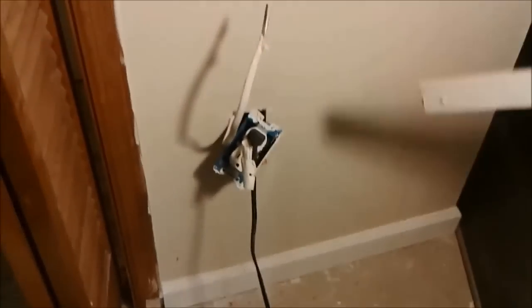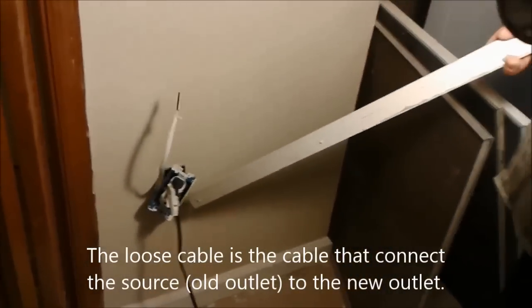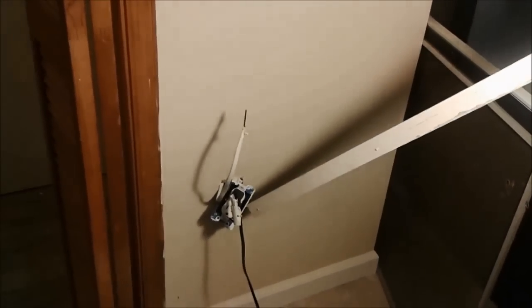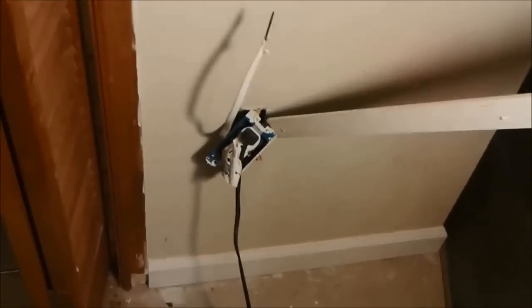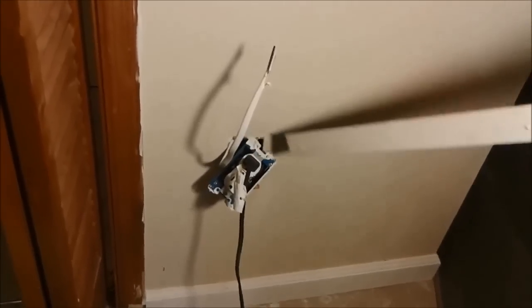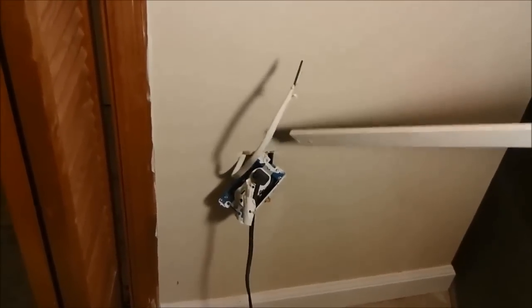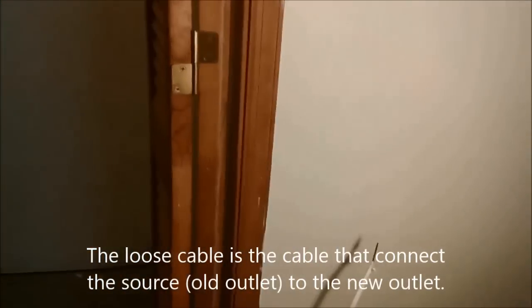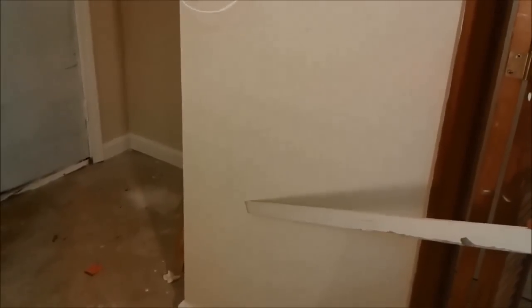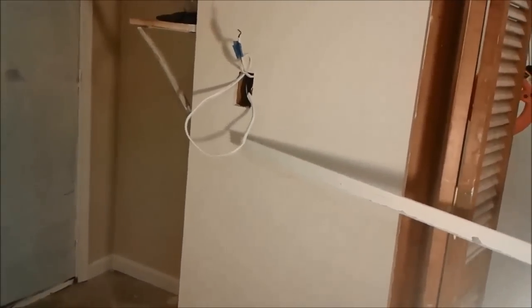My plan is to take the source from this outlet and show you that this outlet is already connected. Here is the light connected to this source. This is the outlet that actually has 120 volts in the United States, but if you are going to do it overseas it is going to be 220. I already passed a wire here, and this wire is going to be the source for the switch and the new outlet I am going to put here.